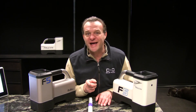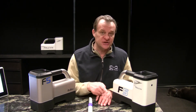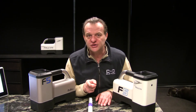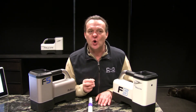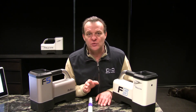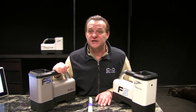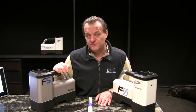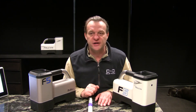Specifically for classic F5 users, if you were to do one last — a fourth rotation — on this RRS sequence, that is how you go into and out of X-range mode. This is only relevant if you've got a classic F5 receiver and a transmitter that's X-range. Falcon F5 users, pay no attention to that — the fourth roll doesn't do anything.